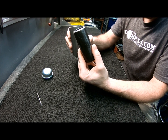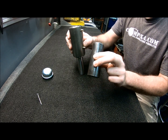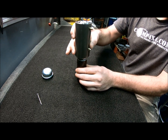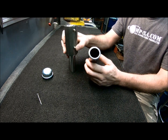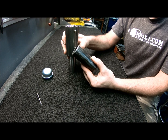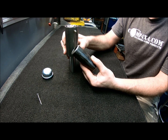Finally, with every one of our single shear kits we provide a sleeve. For the standard duty, the default sleeve is 4.2 inches tall, one and five-eighths OD by one and a quarter ID — that's a perfect machine slip fit for the shaft. On the site the default lengths available are 4.2, 5.2, and 6.2 inches. If you need any other size beyond that, please leave a note in the description at checkout or feel free to give us a call at 801-798-8403.